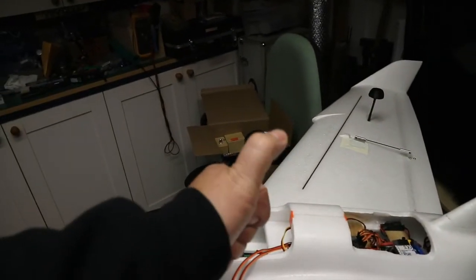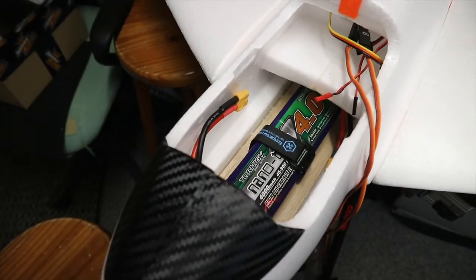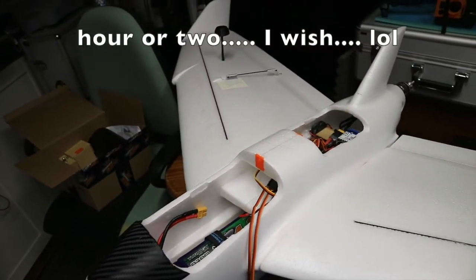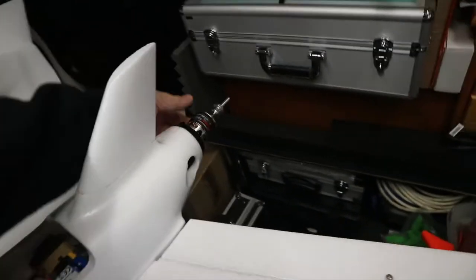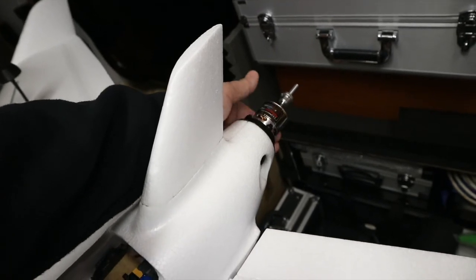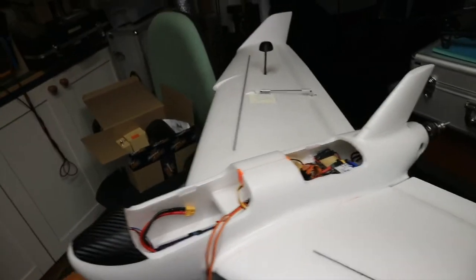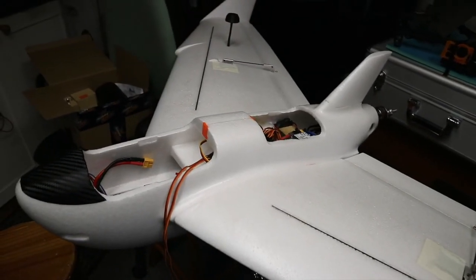My return to home will be my own legs! Plenty of room for the batteries — that's a 4Ah 3S battery in there which I've been balancing with the centre of gravity. With the size of the motor and everything else, I think I can get two of them in there, so I've got plenty of capacity — I could get an hour or two of flight out of this, depending on performance from the motor and propeller. I've got a 1250kV 3642 motor — it's the Aerodrive from Turnigy — a little bit more expensive but better quality, so hopefully I'll get some good performance. I'm planning to run a 10x6 prop on a 3S battery setup. I'm not buying 4S batteries just for this; I fly a lot with 3S. It's getting to the point where I need a nice day so I can fly.